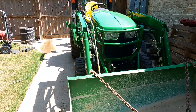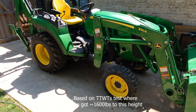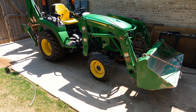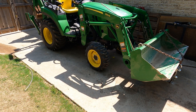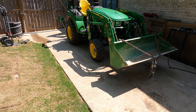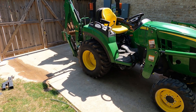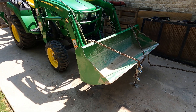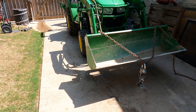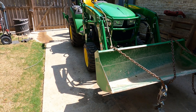2,642 pounds versus somewhere in the 1,600 to 1,700 pound range. So the two-inch cylinders at 3,000 PSI add something on the order of 1,000 pounds of lifting capacity. The 1.75-inch is going to be somewhere in between. This has loaded tires and the backhoe on, so it was light in the rear but we didn't have the wheels off the ground. I think the 1.75 should be able to get about a metric ton — somewhere around 2,200 pounds. I'll do the math and have that more official test in a week or so.